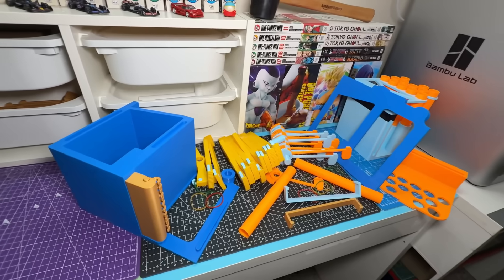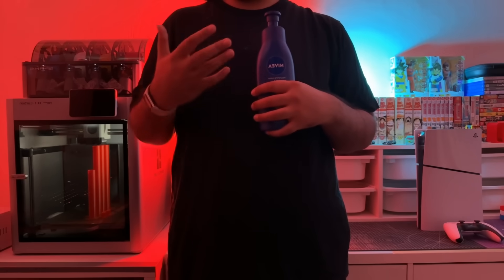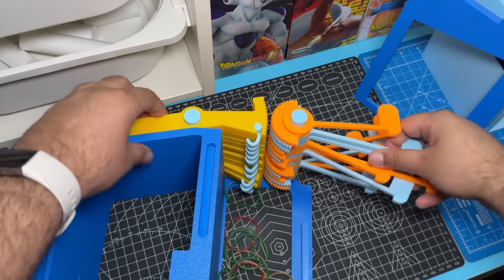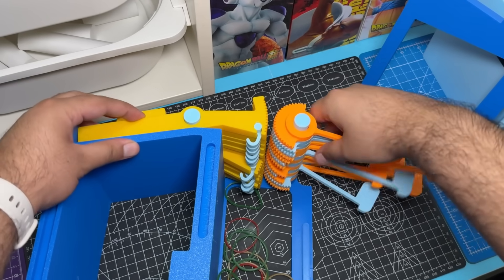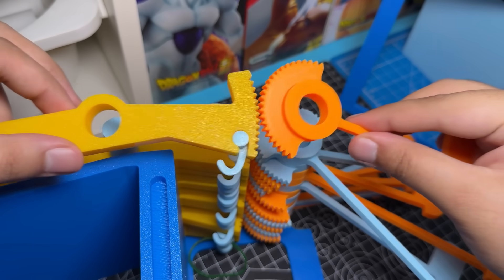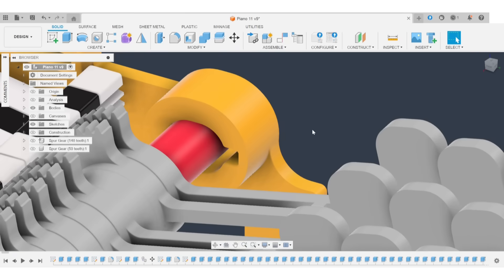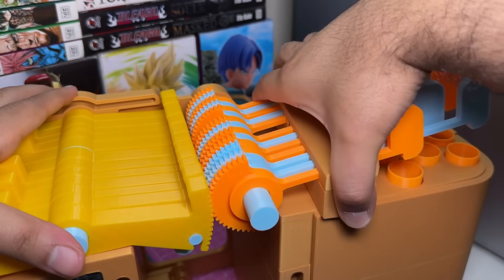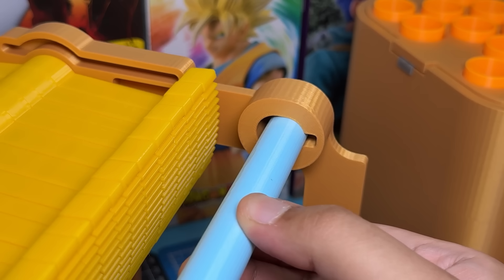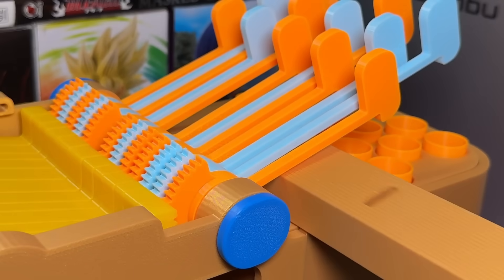Second, the assembly for this thing is a total nightmare — it feels as if an incompetent idiot designed it. Wait a second. Especially the part where you need to align the hammers at a specific angle — it's just such a pain. So I built a mechanism to engage and disengage the teeth between the hammers and the keys. The hammers can now be assembled with the piano in upright position thanks to a spacer for proper alignment and a movable axis. Once the hammers are in place, you just push in the end caps and lock the whole thing.